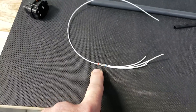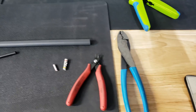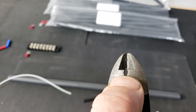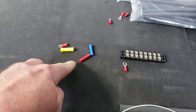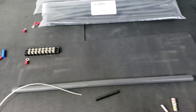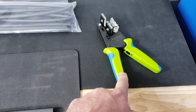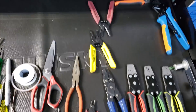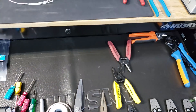The first thing I want to say about any type of wiring — it doesn't really matter what you're doing — use good tools. These are good crimpers; I believe these are Klein. There's a non-insulated port right here and an insulated section here. The cheap ones you get from AutoZone with the color coding are trash — they deflect a lot and don't actually get a good solid crimp. Also use a good quality wire stripper. Klein makes a good wire stripper for standard style wire. Just don't buy the cheap AutoZone special.